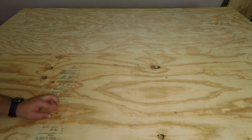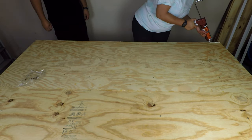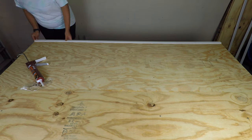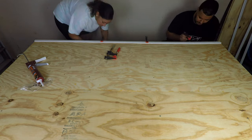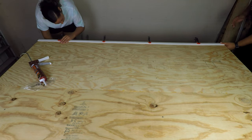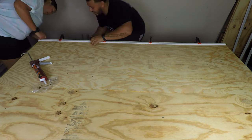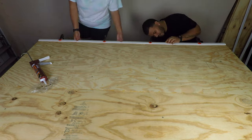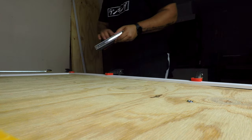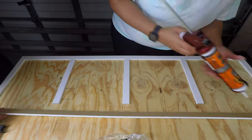Now it's time to attach the outer slats and begin to fill out the grid. We used Gorilla Glue, which is a bit heftier and good for wood, metal, and mirrors — that will be linked in the description box below. We're laying down some glue along the sides, laying down the slats, and instead of putting the nails through the top we're putting them through the bottom so we have much less to spackle and fill in later. We started with the glue first, clamped the piece into place, cleaned it up, and then went in with the nails from underneath.